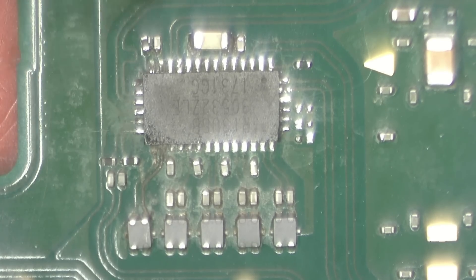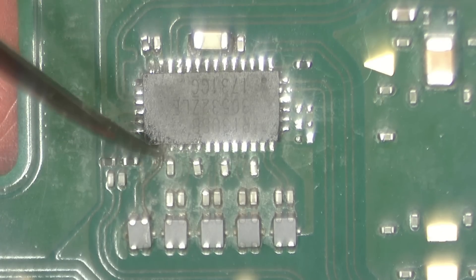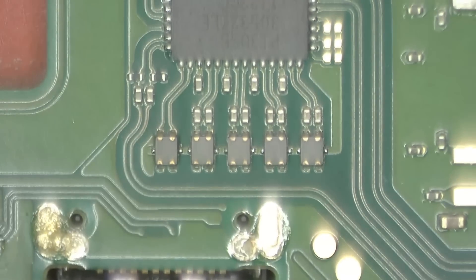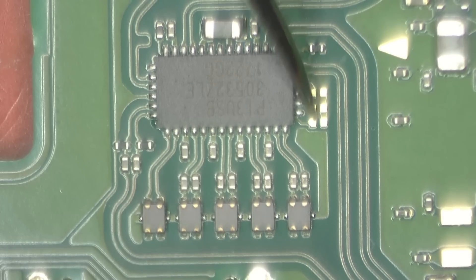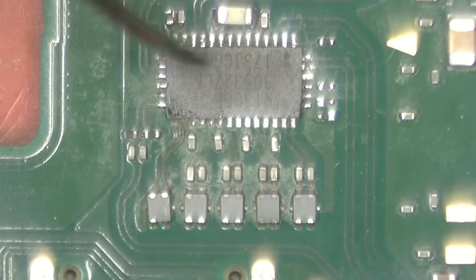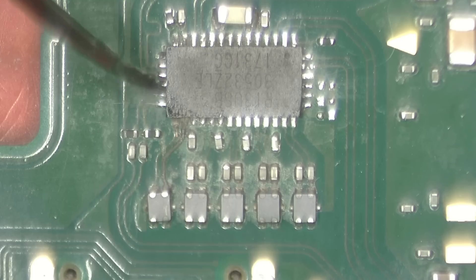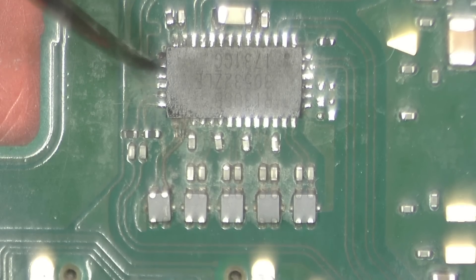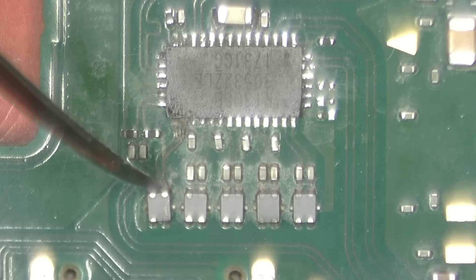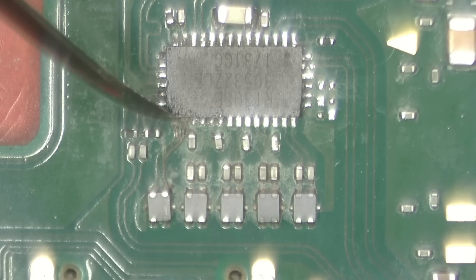So the first thing I'm going to do is get this chip soldered on correctly, make sure we have all the components we need, and then go ahead and repair these traces. Comparing to a donor board, apparently those missing components are normal, so no worries there. Now let's get to the repairs. I'm going to heat this chip up and get all of these pins soldered on correctly by rubbing each pin with my iron to connect it to the pad on the motherboard. Then I'm going to place a wire between this point and this pin on the chip, and this point and this pin on the chip.